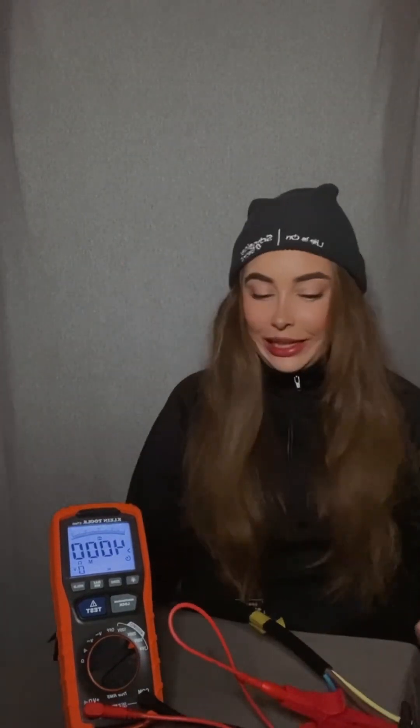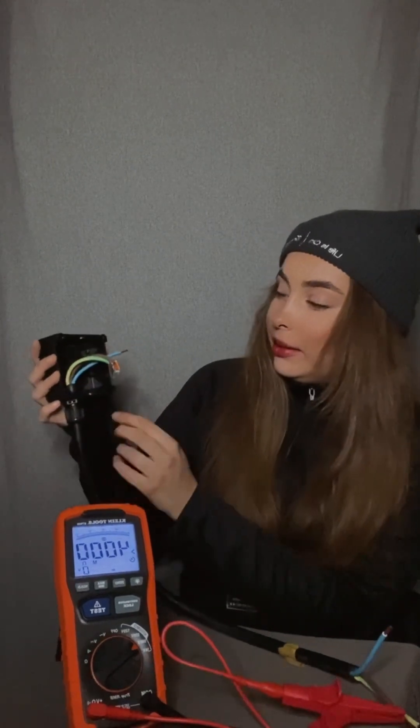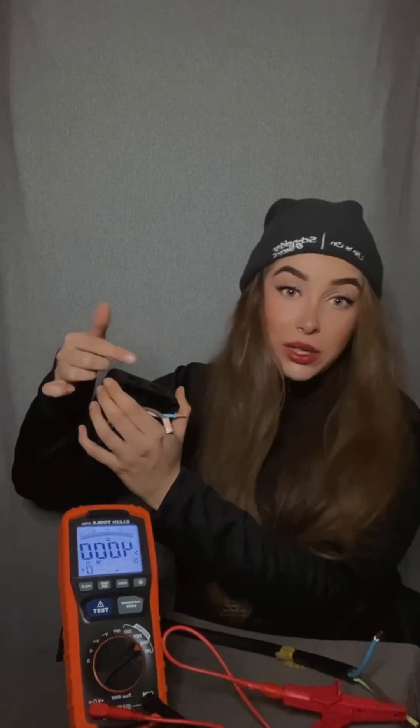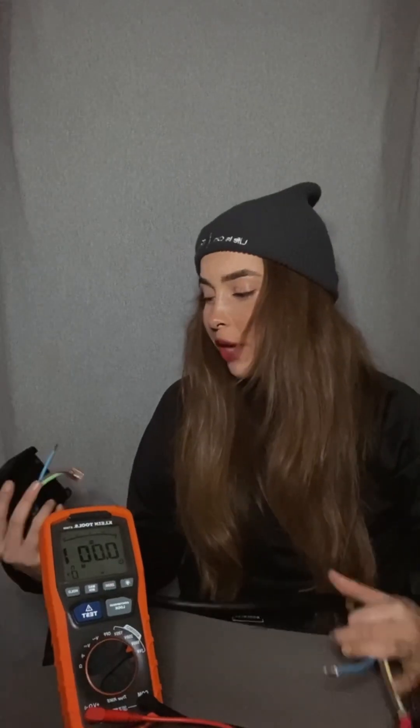Let's do this test again, but this time I've made a fault in the cable — I've stuck a wire going between the live and earth. So this could mean there's damage in the cable somewhere, or this box is full of water because Dave down the pub didn't do up the stuffing gland. The result is 000 — that means somewhere in the circuit the cables are touching, and that is here. Am I making sense? Are you with me?